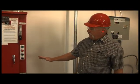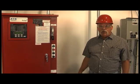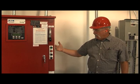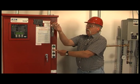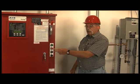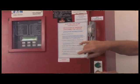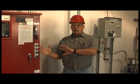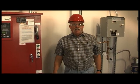We spoke earlier about working with the electric fire pumps. There's an element of danger in there because of the high voltage. So anytime that we're going to turn the power on or off, we want to make sure that we stand off to the side of the control panel, hold the stop button in, turn the power on, and then ease the stop button out. And then we're good to go. Same thing if we're going to disable a pump or shut it down, we want to put the stop button in, turn it down, and then ease the stop button out. That way there's not a problem. If something does happen and the door does come off like that, then we're off to the side. We're not going to wind up getting a kiss out of that one.